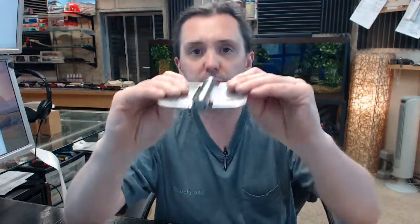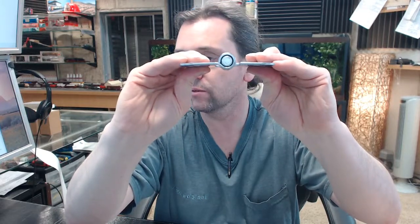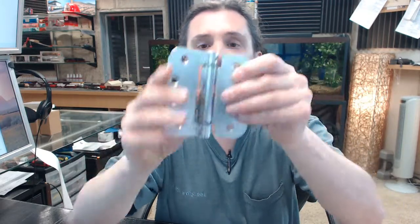Being an LB4312 by Bommer, as we said earlier, it's a full mortise hinge. You can see from the swag on the hinge leaf here that the hinges are meant to be flush when mortised. They're intended to be mortised flush to the edge of the door and frame when the leaves are brought parallel. Typical common thing.